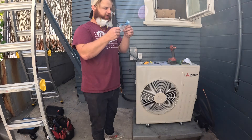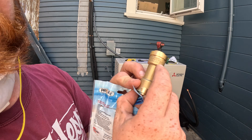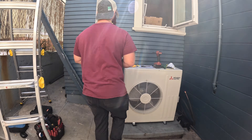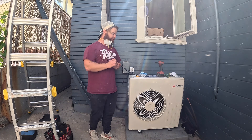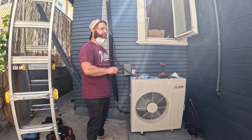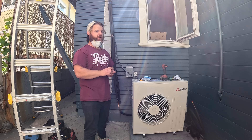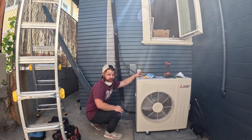It says right on them that they are rated at 870 psi. Any HVAC system has a high pressure switch — usually I've never seen one over 700. I've seen several around 500, and I think most high pressure switches on systems are around 550 to 600, but I could be wrong on that.